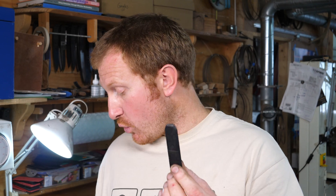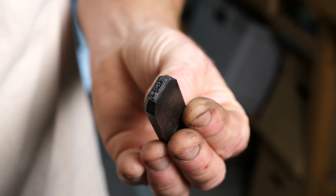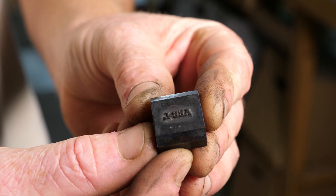Basically you send off whatever you want to be made into a stamp. In this instance I just wanted a steel type - I hadn't got a steel stamp for my AEBL steel, so I sent off the text and told him what size I wanted. Chris up at Davidson's made me these stamps: he made me one as a hand stamp that I can use with a hammer, and then he made me one that I can put in my hydraulic press.